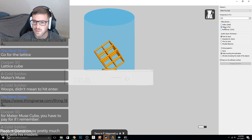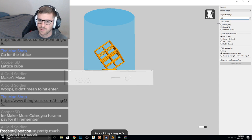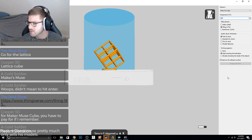Okay, so what do you think we should do for settings? We'll do 205. I think 210 is a little too hot. What do you guys think? 17 or 33? I feel like 17 is probably fine, but... And then what do you guys want to do for the quality? I printed this guy out in 0.2... We can try 0.15. I feel like it might take a long time.